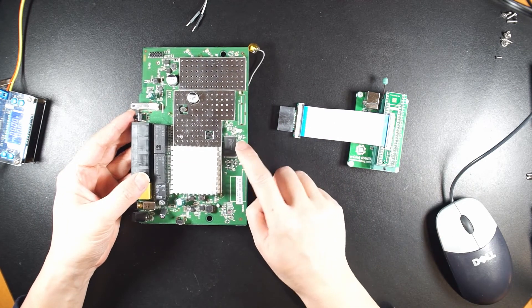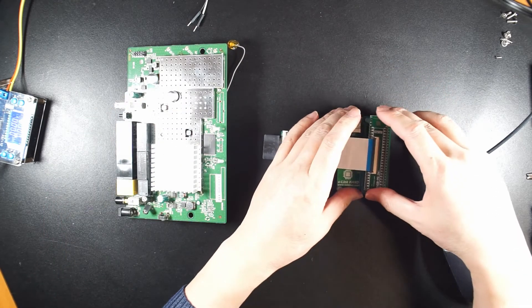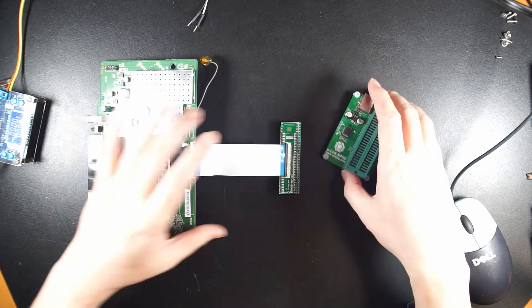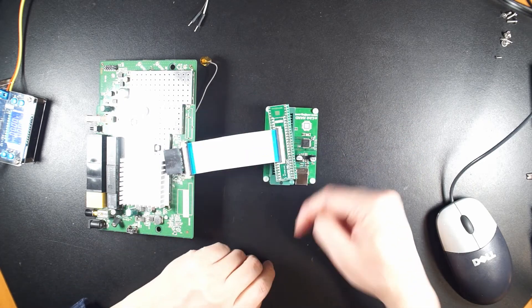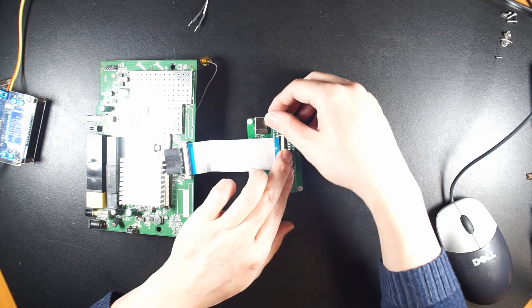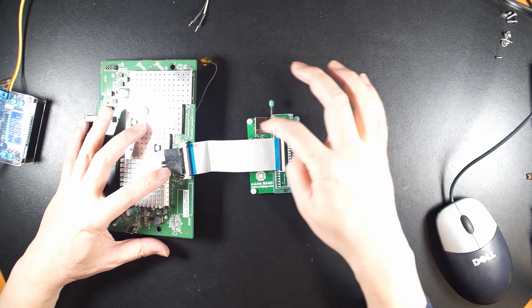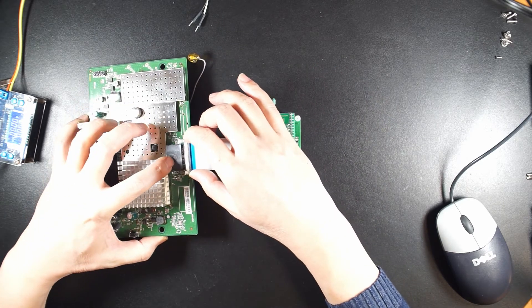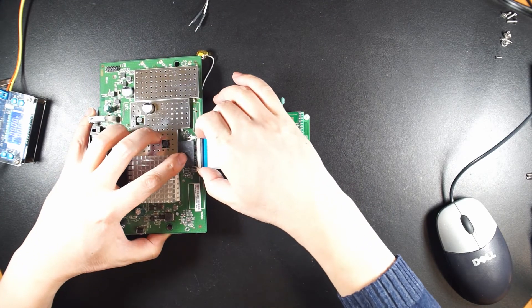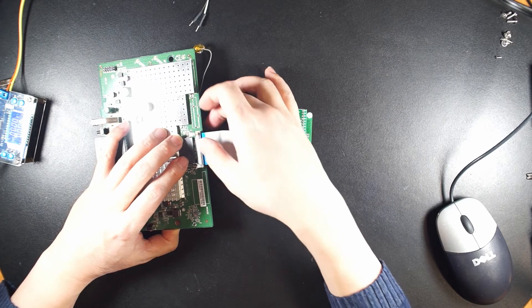The chip has pin 1 on this side, and our clip also has pin 1 on this side. So the only way to make the connection is like so — instead of orienting pin 1 this way, we go this side. We can still see that pin 1 matches this way. The spacing for the components is just barely enough for this clip to work.